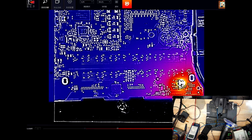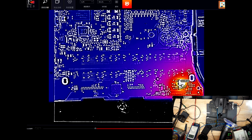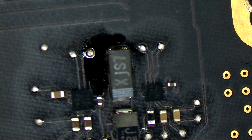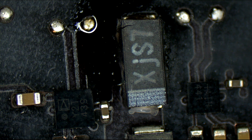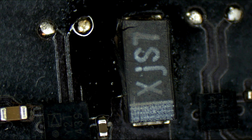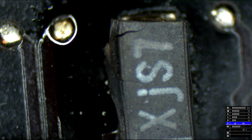Do you smell that short? Wow — 195 degrees Celsius on the thermal camera, and this is a cracked capacitor. There are a couple of signs that make it obvious this is the bad capacitor. The primary sign is that it's cracked along the upper left corner — that is one nasty capacitor.